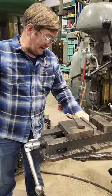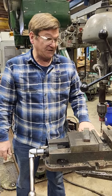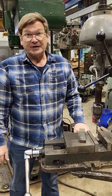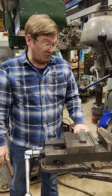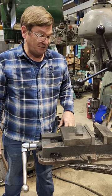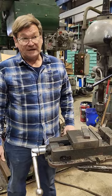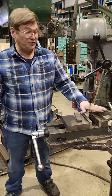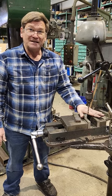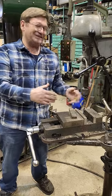You can also add an XY stage to these, and you can get all kinds of fancy setups at home if you need to. But in a normal shop, you're using the drill press for second operations — the hole is already there, you're just trying to line up on the old hole, letting things move on their own. You are not using it as a first tool. If you are using it as a first tool, and a lot of times they do that in school, it's so you realize how hard it is and how much you'll have to learn to do precision work without indicator dials on a milling machine or a CNC.